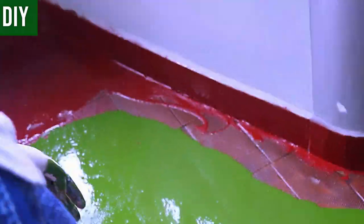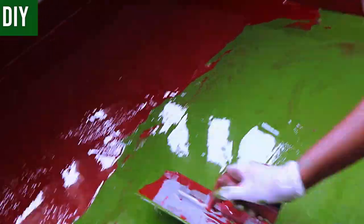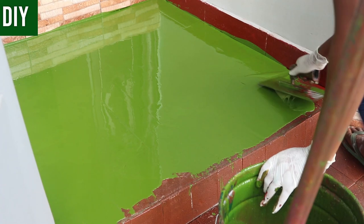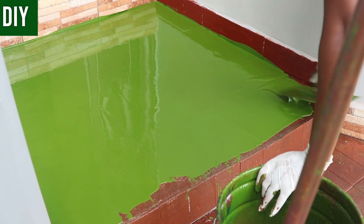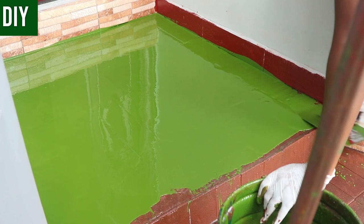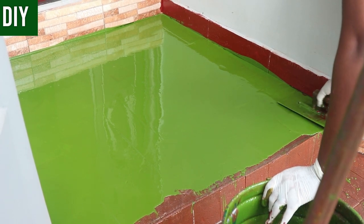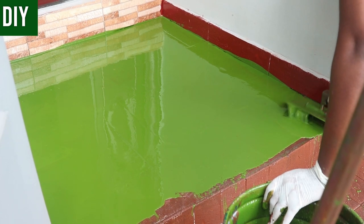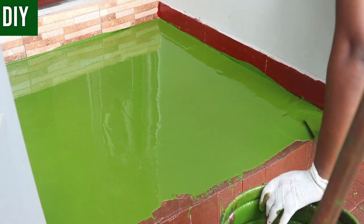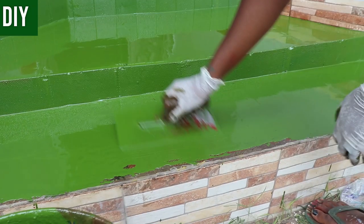Measure your materials in batches. Don't try to measure out too much at one time, as some of what you measure will get to cook and be wasted. If you wanted a reflective floor you could stop at this mid coat stage with all the shiny mirror-like coatings. However, for a 3D epoxy we continue. Coat the floor surfaces completely, coat the wall skirtings completely, work over with spike shoes for touch-ups, and repeat the process until completely covered. Pour out the mix onto the floor and spread it like butter on bread.